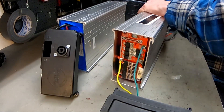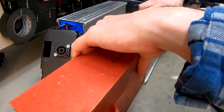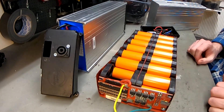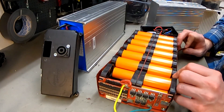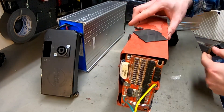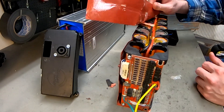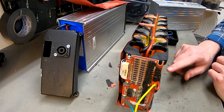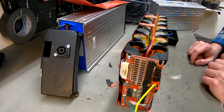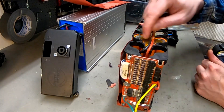I even had one of these myself but was disappointed because it had LiPo cells and not cylindrical cells. I wanted to open it up and look at the cylindrical cells, but they were using LiPo cells in my case. Here I don't know which brand, but I'm guessing Molicel — they have orange 18650s that we've gotten a lot of before with a really strange config. This is most likely for 14s or dual 7s. Custom holders for this case for 20650s — I've never seen that — and also custom nickel strip.